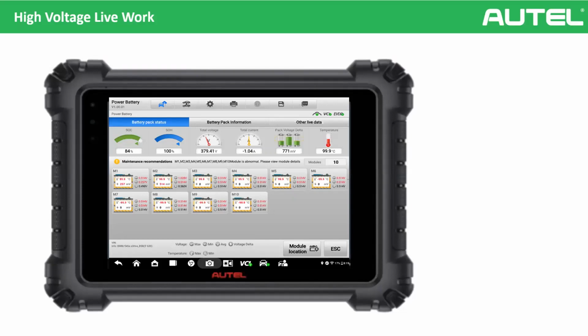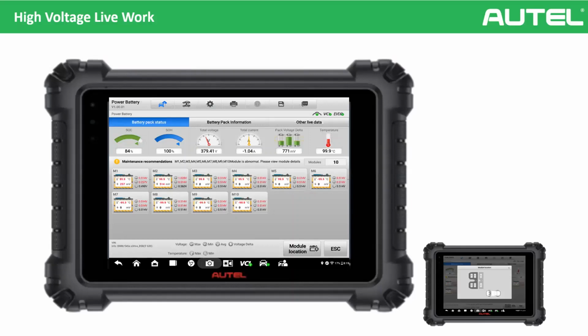And if there is a need of repair, if there's a need of replacing the cells, yeah, you will do it. But you don't know where it is, right? So you checked in the diagnostic tablet, where is module 14? You checked it from the diagnostic tool, and you started the process. You de-energized the car. Of course, we are dealing with a high voltage battery, so that's why we are wearing our PPEs, and we are taking the battery off the vehicle, okay?